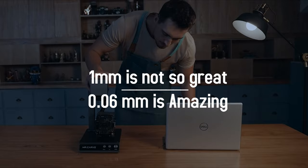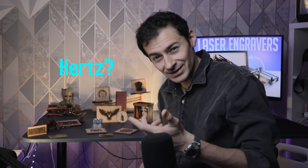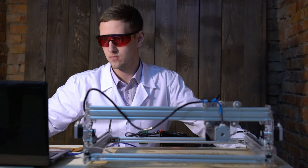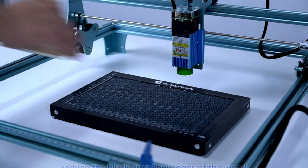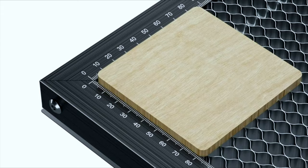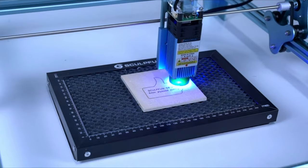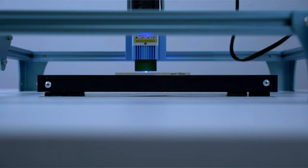It's important to know that the blue laser emitted from these machines is very strong and will cause severe eye damage if looked at directly — a blue laser hurts twice as much as a red one. Therefore, many machines cover their lasers with a protective cover. It's better to be safe and wear protective glasses or watch through a camera. Also, the bed that goes under your engraver is essential — honeycomb beds are the best.